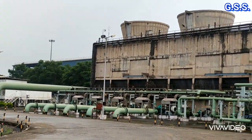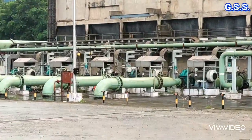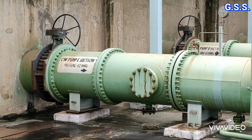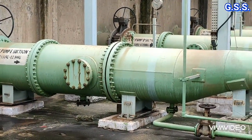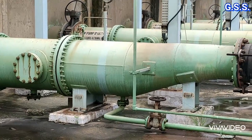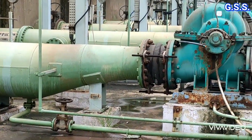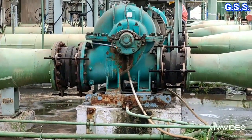This is an outdoor installation of cooling water pumps in front of a cooling tower. For each CW pump on suction side, isolation valve is there, then conical strainer is there with hand holes for cleaning, then eccentric reducer and then rubber bellow is there.